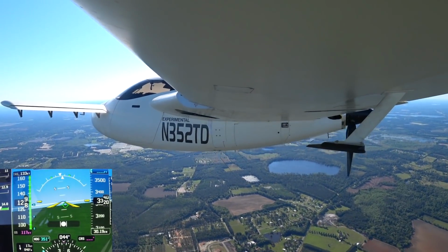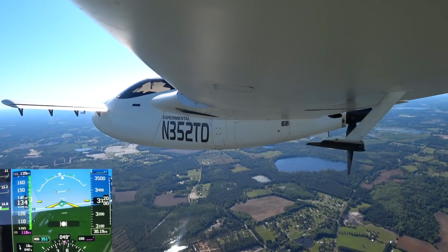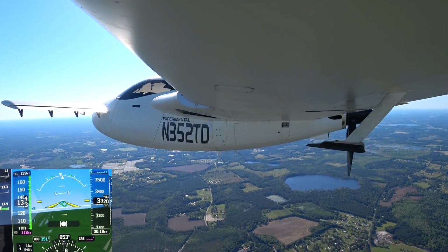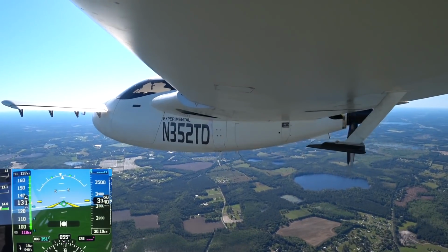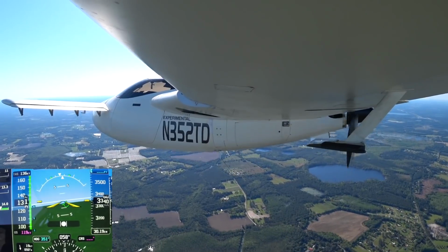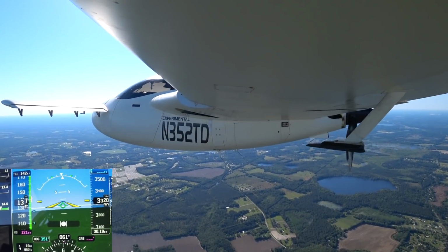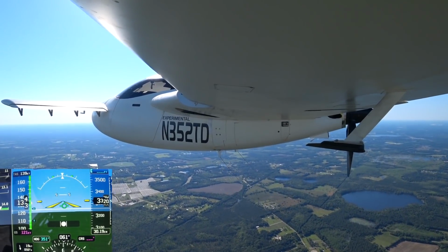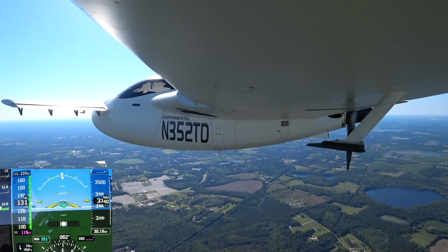Anyway, what my thinking is with the oil is that potentially I'm running too light of a weight oil here, because I'm running 5W30 right now, and I believe I used to run 5W40. So I'm talking to a few different people to get a recommendation on what oil I should be running there. I think if I go to a 10W40, I'll be better off, because the oil seems to be a little bit too thin because I'm running it at high power most of the time, or all of the time.